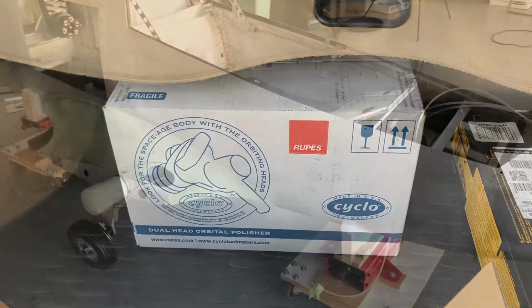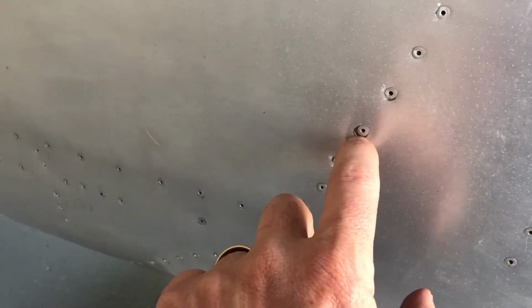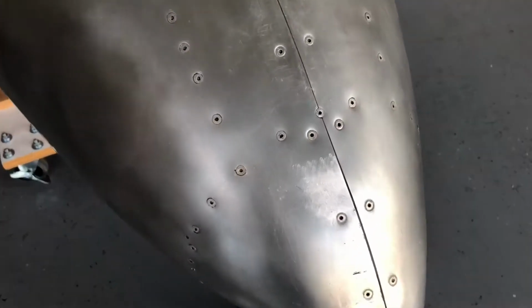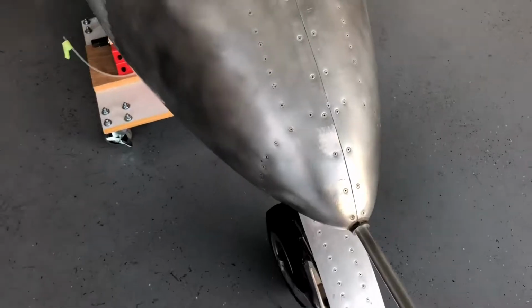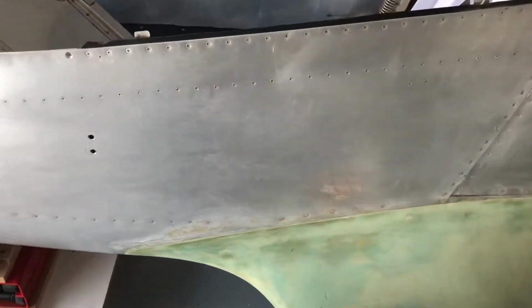But in preparation for that work, I've got to go through and find things like where this Pro Seal is on that rivet. Clean all of that out. Use some very fine sanding compounds on some of the scratches that are in here to try to smooth them out. Take some of the super fill that was used when this winglet got put on the wing root, and make sure I can cut through that material.